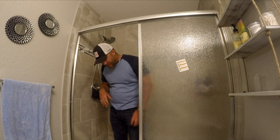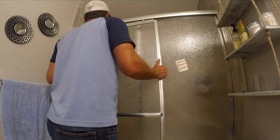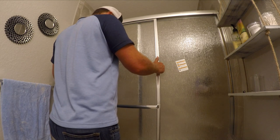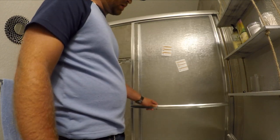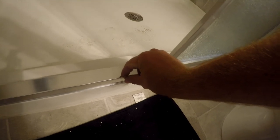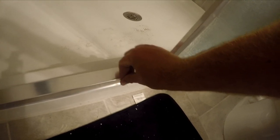Put a piece on one side so it can't flap and fall out. Slide the doors back and forth a few times to make sure they're square at the top and bottom, confirming everything is lined up right. Keep adjusting the little wheels until the door is square — you might have to take the door off a few times to get it perfect. There's a little plastic insert at the bottom; make sure it sits on the lip and isn't bent, otherwise it won't slide smoothly.